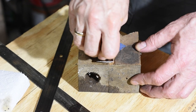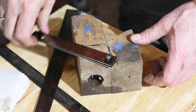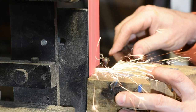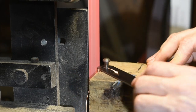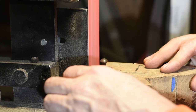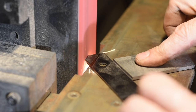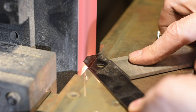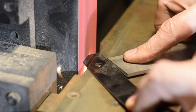I'll want to round off the top of these so that they don't pinch your fingers when you're using them. I'll do that by using this little piece of scrap wood as a sort of fixture to line them up, and then I'll just round those ends off on the grinder. I'll also grind angles on the business end — this allows you to have a little bit more precision of where those points are on each end of the divider.